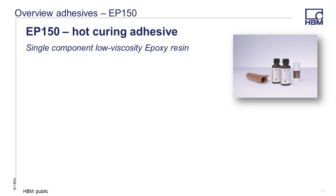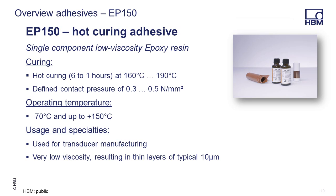EP150 is a single component hot curing adhesive. This is typically the adhesive that we use internally for HBM transducers such as load cells, torque transducers, etc. The adhesive should be opened only at room temperature to prevent condensation from getting into it, and should be vigorously shaken before being applied to ensure homogeneous distribution of the contents. The adhesive is applied to both the gauge and the surface location and allowed to dry so there is a sealed layer on the measuring point and the gauge. Once dried, the gauge must have a layer of Teflon tape, a rubber layer or blotting paper, and then a metal plate with applied pressure around the gauge location. The oven should be set to at least the same level, or ideally slightly higher, than what the application is rated for. The instruction manual provides a table describing the length of time and temperature required to properly cure the adhesive. It is important to follow the instructions, as bubbles can form in the adhesive if the temperature rises too fast.